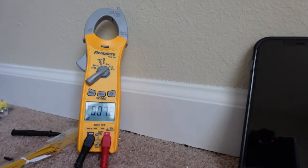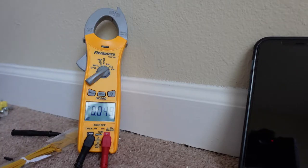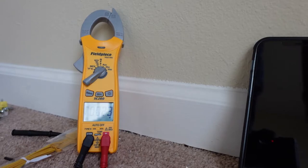Hello guys, this is Dan Giles coming to you from inside an apartment where I'm going to replace an outlet — and this is not just any outlet, it's a switched outlet. I have my voltage meter here and I want to check where my switched outlet is and confirm I've got voltage. This is the bottom of the outlet and I'm going to test the top. I do have 120 volts going to both, so I'm going to hit the switch on the wall and see which one gives me no voltage.